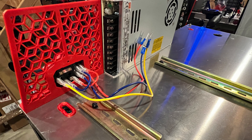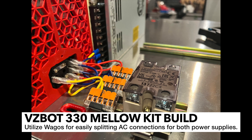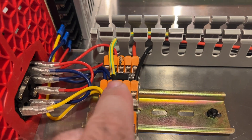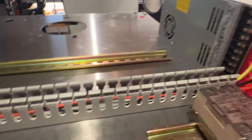We're going to move on to the red one. Just repeat the crimping for all three wires. I went ahead and connected these directly to the AC side of the power supply. You should see an N, L, and an E or earth symbol on your AC inlet, and those map directly into your power supply side. I've been using WAGOs - these allow you to basically split off any of your wiring connections. Rather than going directly to the power supply, I went to the WAGO and then to the power supply from there, for both the 24-volt and 48-volt. Don't forget about your earth wire.